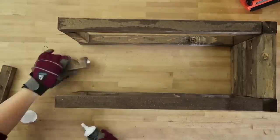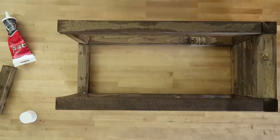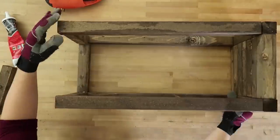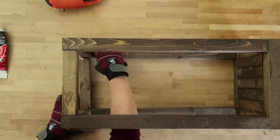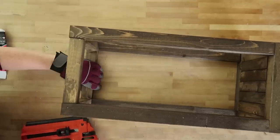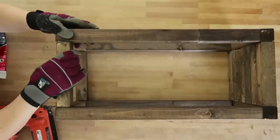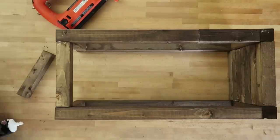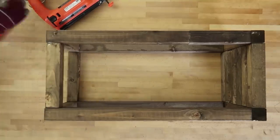After I put the vertical pieces on, I'm just putting these horizontal pieces on the top — these are the final four seven-and-a-half inch long pieces of two by two. You might need to hold the lantern up with one of the loose pieces when you put the other piece on, and they each go in between the long pieces just like this. This is a really easy build. If you're really new to woodworking, this is a great one to start with because it's so simple — you're just using two by twos and doing straight cuts. If you have access to power tools and you have someone show you how to use them, definitely a great one to try.